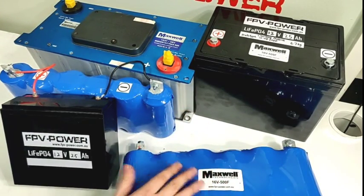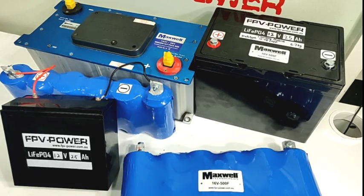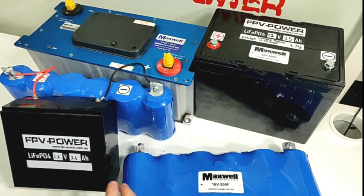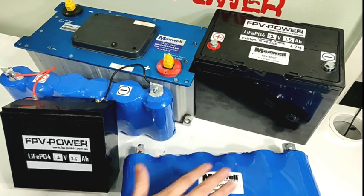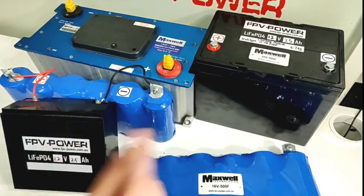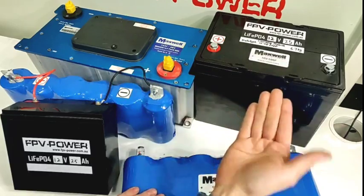Not too bad, but nowadays, modern cars, it's not like your old Datsun 180B. You turn the key off, pull it out, that's it. Nothing's running. There's no alarm system, there's no computer, there's no ECUs, nothing. Whereas with the modern cars that we all have these days, you pull your key out, and they call it the parasitic drain on the system. Just minute, small currents, going every minute. So with that, it's not practical to have just a supercapacitor to replace your batteries.